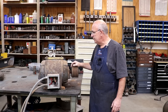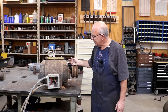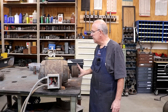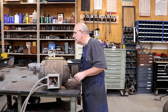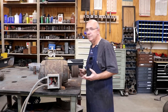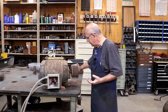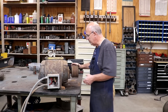A viewer recently dropped this motor by the shop, more or less donating it to the cause if we can use it. I do like this motor — it looks a little bit more vintage. It is a seven and a half horsepower, three-phase motor made by the U.S. Electric Motor Company. We need to see if it's a good candidate. It spins up pretty good and the bearings sound good.